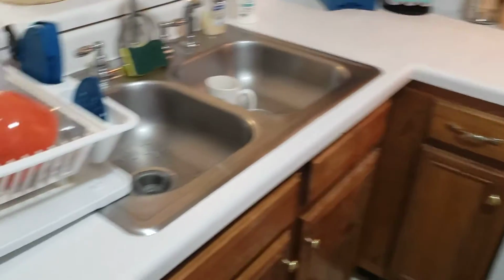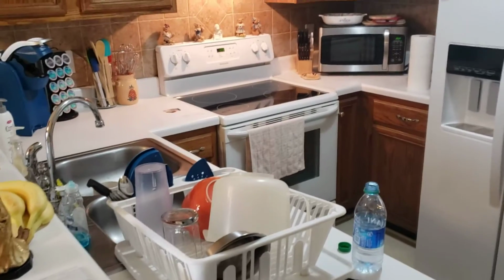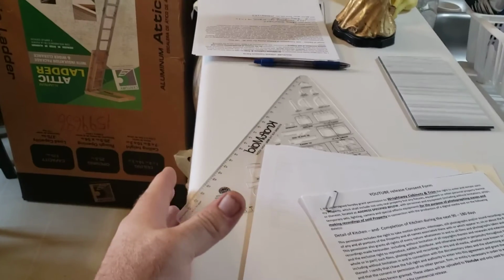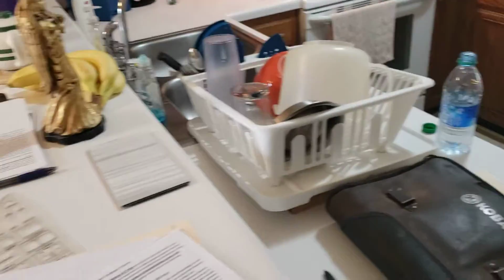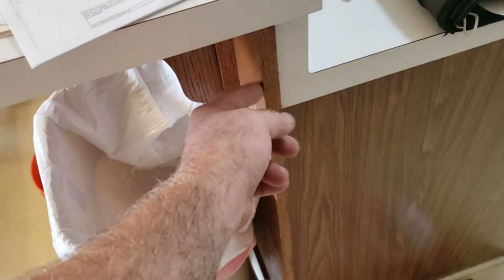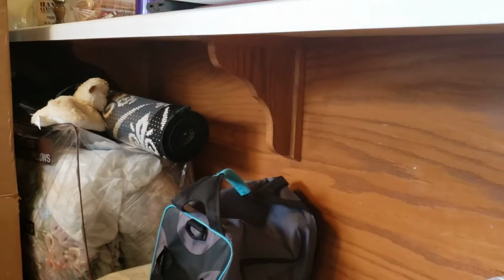Now, one of the other things in this design was the customer had 120 inches in your drawing from that wall all the way to the end. Well, this is 117. It's 117 from the back of the overhang of this cabinet all the way back into that corner. So she's okay with 117 worth of cabinets being here, the 12 inches, and that'll work out because right now this is a 3/4 inch back panel. This is just a solid 3/4 inch panel with some overhang brackets holding that bar up.